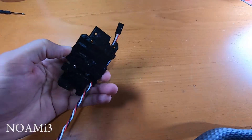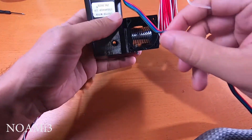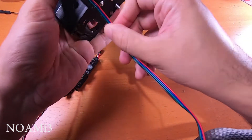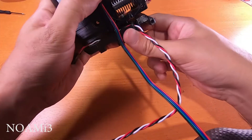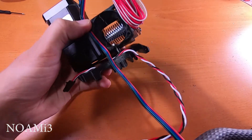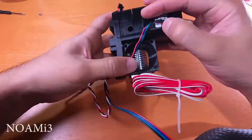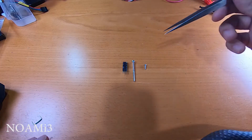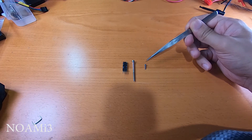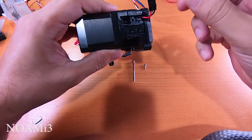Install the filament sensor cable — the side with the clip goes towards the top, and the wire goes right in the groove. Next, take the X carriage assembly and join it with the extruder. When tucking the cable into the groove, leave a little bit of slack behind the extruder. Tighten the screws a little but not all the way — we will adjust them later.